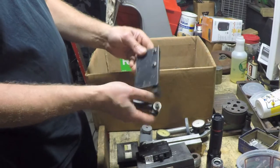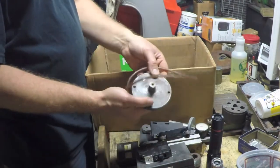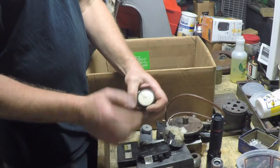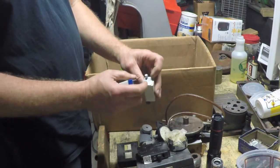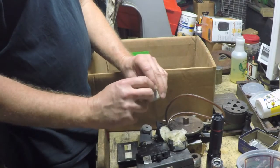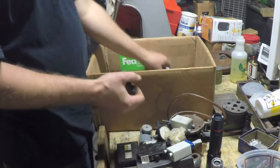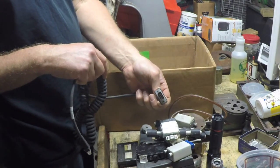There are a couple of items I'm not sure about — some kind of little jigs or mounts. These look like indicator backs. Here's another one of those Baity indicators; it's sticky but it works, and they're small — about the size of a half dollar. There are also some items that look like they plug in somewhere to calibrate something. They've got numbers on the back, and if you lift up the little doors there are set screws for trimmer adjustments. These might have plugged into the back of one of the electrical boxes that went with the Tally Surf. There's a funky plug, a couple of rollers, and a cord going from a D-type pin plug.